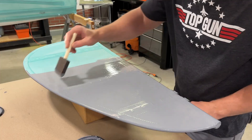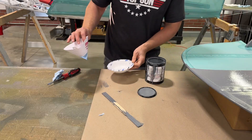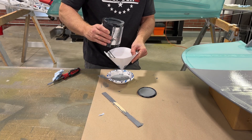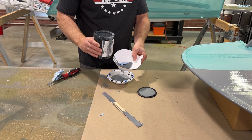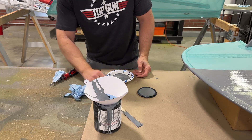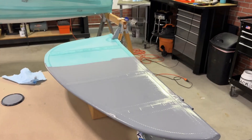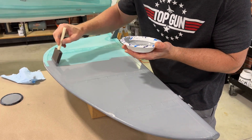There's a little glob of something. I have to admit I made a mistake because I was paying more attention to that camera. You're supposed to strain this so you don't get any little clumps in it, and that's what I've been doing — I just forgot. When I was dipping the brush into the can, something felt different, because I didn't strain it and use it out of a little bowl like I've been doing. That's okay, because if there were any little chunks in there, this is only the first coat so it gets sanded out anyway. Let's continue on using this with the filtered filler.